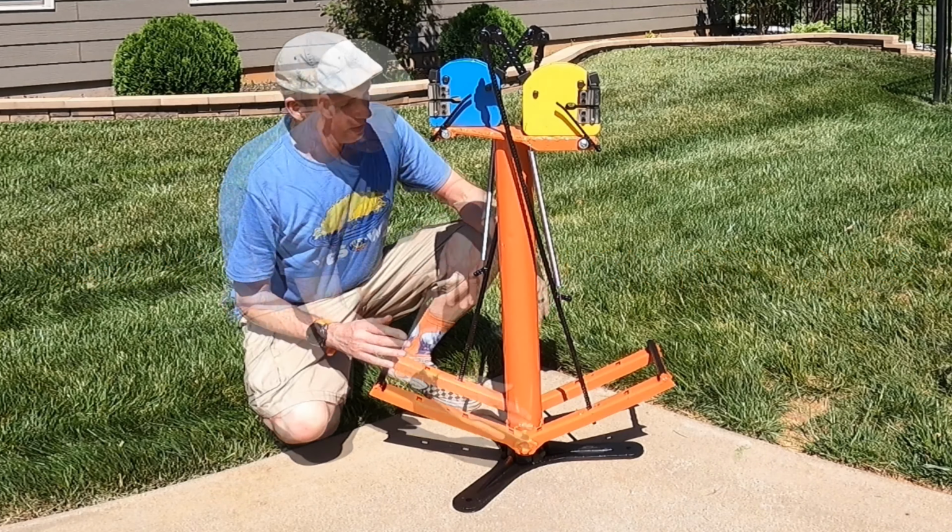Our foot bar here is made out of rebar, same here, and heavy rebar up here for these handles. Welded on tabs for the handles. Smaller rebar runs down to my pedal assembly to actuate the actual shrinker stretcher. The springs that act as a return for my pedal came out of a dishwasher. They used to actually hold the door. Almost everything in here was free.